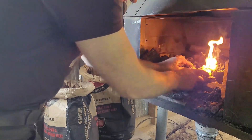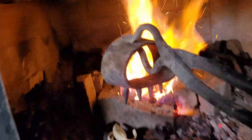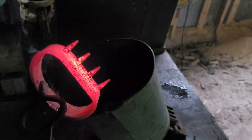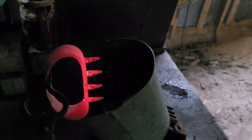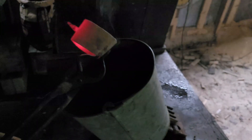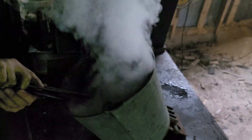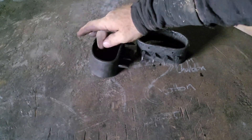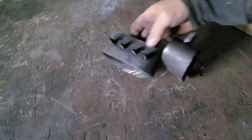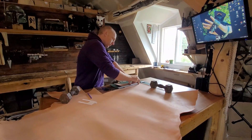This is the heat treat fire — the best fire of all. The steel teeth need to be brought up to a dark cherry red and I'm going to quench in oil. For blades it would be water, but for something resilient like these spikes, I heat treat in oil. Waiting for that dark red to get into the center of those two teeth. I've also skipped over sharpening each one — they needed to become quite shiny for this stage. Now this is going into the oven to be tempered and I need to watch each tooth until it gets to that straw color. That means they've got their full temper. I pull them out and don't quench in water — I want the resiliency, so I let them air cool.